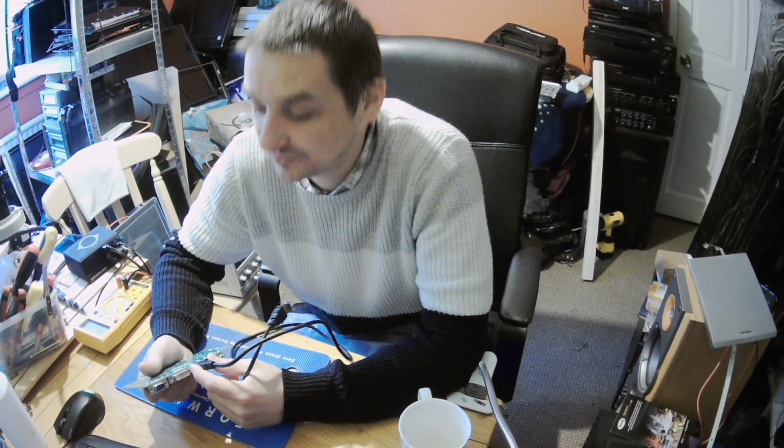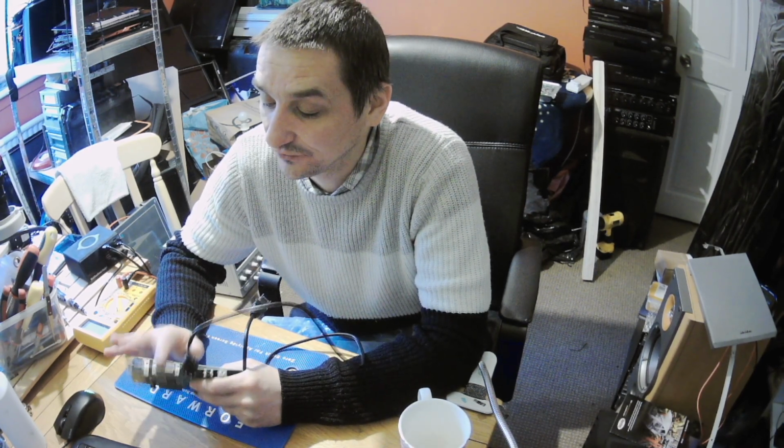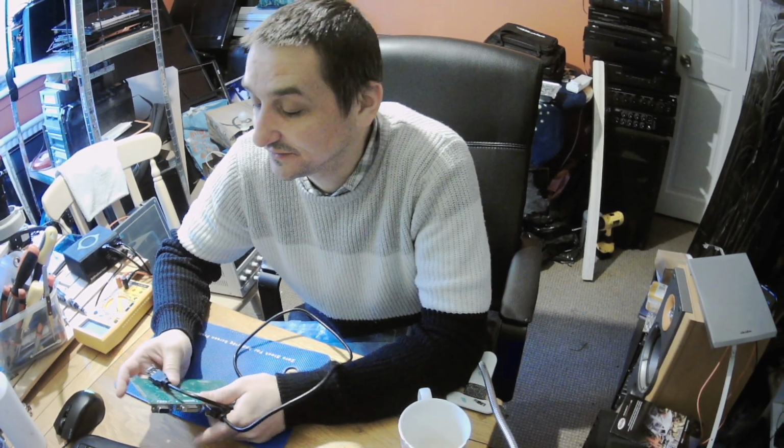And as well, HDMI was based on DVI, so the communication is again a bit different, but you can use a higher resolution on this as well. So I wouldn't say it's a problem for the customer. I would say that DVI would be okay. I would be doubtful about VGA, depending on what resolution, hertz and frame rates the customer wants.